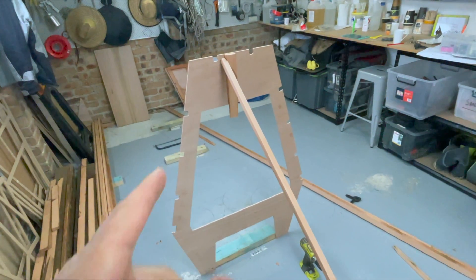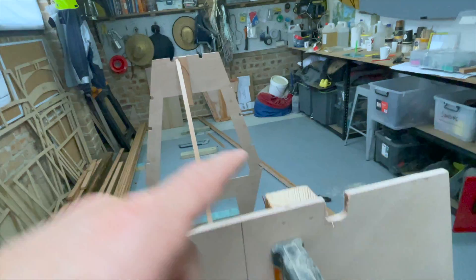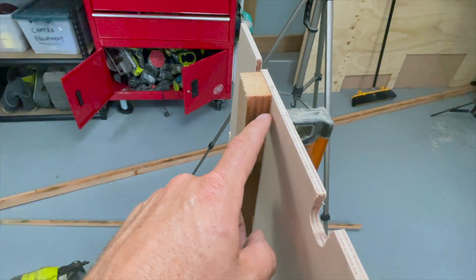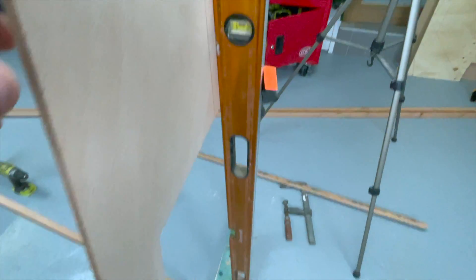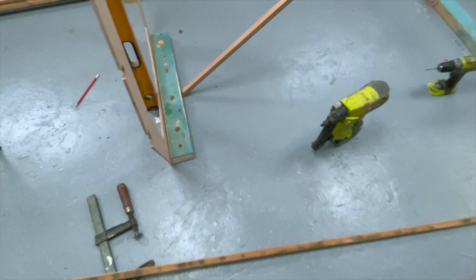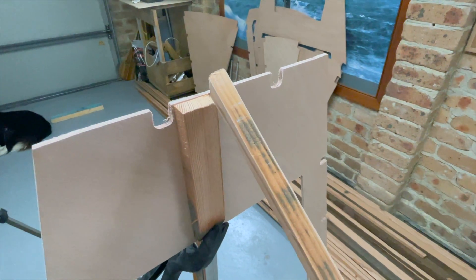Bulkhead 5 is now braced and plumb, and now it's time for bulkhead 4 to be made plumb and braced. My process is to put a couple of nails with my nail gun into an extra piece here, which my brace will attach to, and will be embedded down into the block for bulkhead 5, coming up diagonally. I've got a gauge for vertical with my long spirit level here, and I have my piece already cut. It will go in there, get a fastening where the two pieces meet, and then it will get fastened up here.